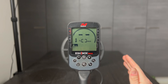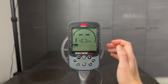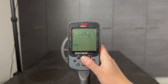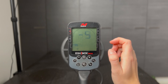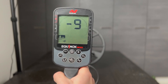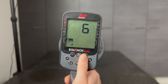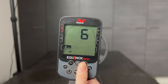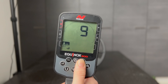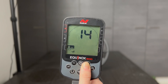You can adjust the ground balance both manually or automatically. For adjusting the ground balance manually, press the settings button until you come to the ground balance setting, then raise and lower the coil on the ground up and down. I'm inside so it looks a bit odd, but you would choose a patch of ground where there's no targets underneath, go up and down, and choose the channel that makes less sound.